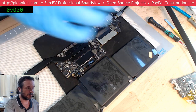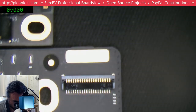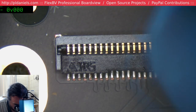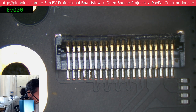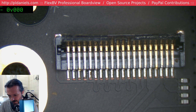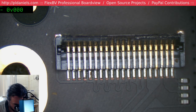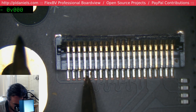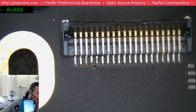Hey, Max. Oops, that was a little aggressive. So, theoretically, I should be able to shove a pin between 4 and 5, and we better damn well get something that boots. So 4 is ground, 5 is on off L. That should be more than enough to boot it.